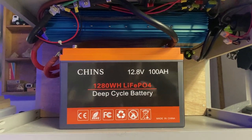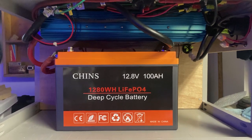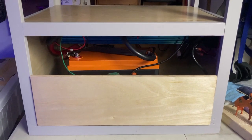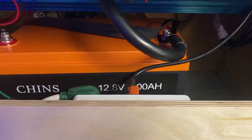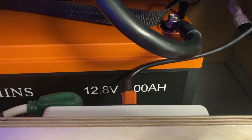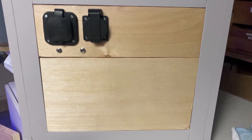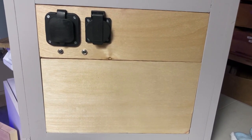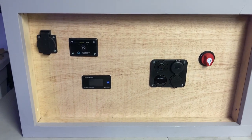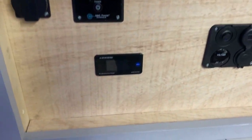The 100-amp-hour battery fits in here with plenty of room to spare for a 200 to 300-amp-hour battery. I generally need no more than 6 hours of backup, but I will be installing that 200-amp-hour battery just to give my family plenty of capacity to run their devices as well. The 100-amp-hour battery will be used to build a second, much simpler system for the downstairs frag tanks. Right here you can see where I mounted that grid kill power switch — I can easily fit my hand in this ventilation gap to switch it on and off. The half panel in the back allows the inverter's fans to evacuate hot air, and the panels on both sides are press-fit and easily removable to maintain battery and hardware within. The system should run for 10 years with little to no maintenance required, though I may want to install a solar charge controller at some point in the future.